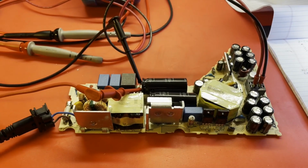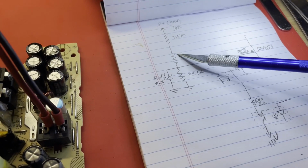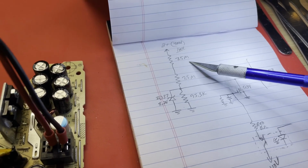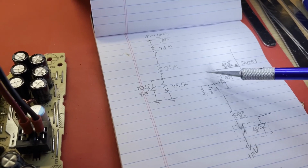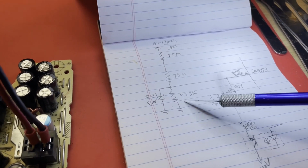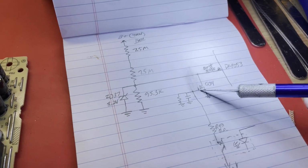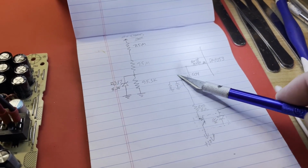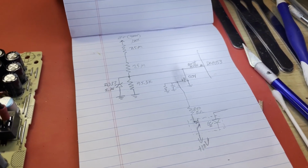Well, I have lifted one of these resistors so I could check both of them since they're in series, and they check perfectly fine, no problem. And measuring on this pin here, pin 2 into that IC, I measure about 100K, a little less than 100K, which is probably this resistor to ground right here. So that seems fine. I have removed Q34, just taking that out, just disable that shutdown, just to make sure that's not causing some kind of a problem with our divider network for our feedback.